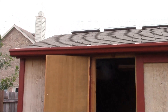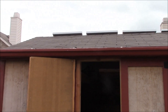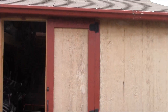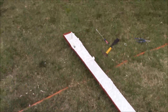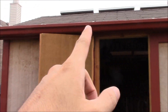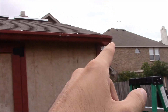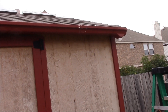This is day three of getting the gutters installed. As you can see I've got the front gutter installed. I definitely need to touch up some paint and paint the hangers to match as a finishing touch. One thing — as with most any project you learn as you go — it's definitely going to be easier to pre-assemble the whole piece before you put it up. Yesterday I put up the long piece first, then the connector, then a 23-inch piece, then the downspout, then the end caps. It's doable but it was a lot more work up on the ladder.